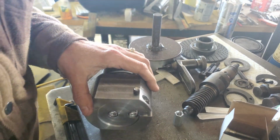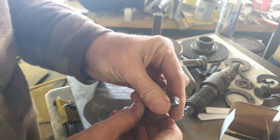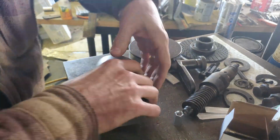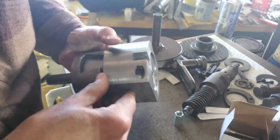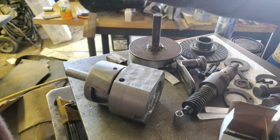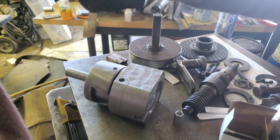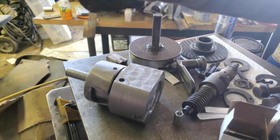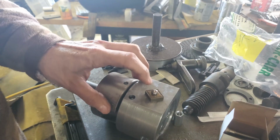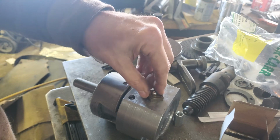Now this is going to take a little finagling. So we got that cone, which loads into this hole. But before that thing is seated, first, want to make sure that face is completely clean. I need to take a bearing ball and drop it into the pocket. And basically what will happen is that ball will apply thrust to this insert and jam it down into the corner.